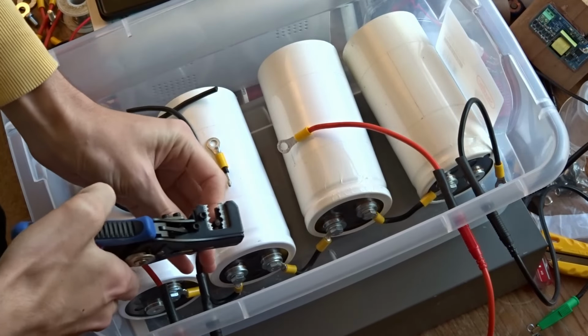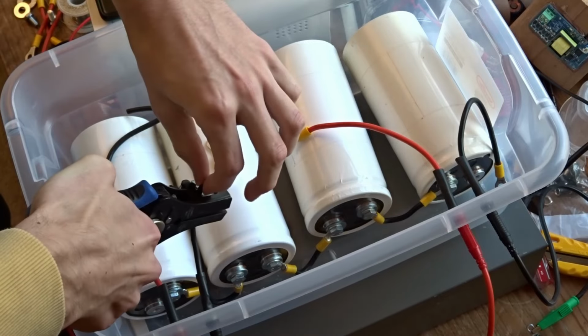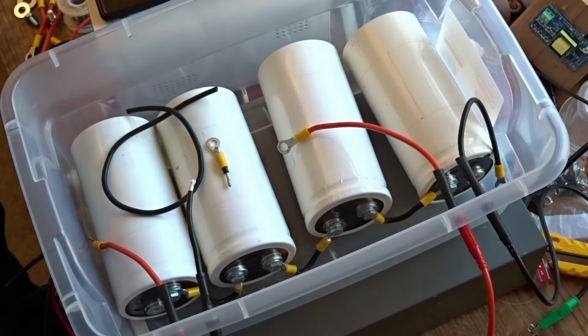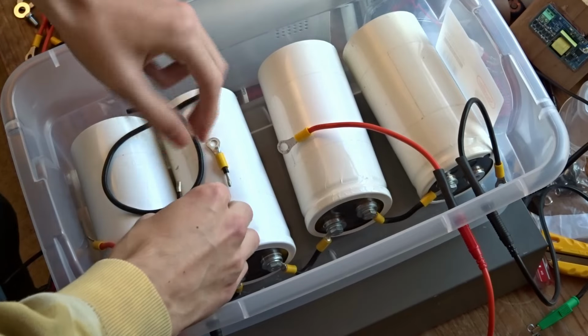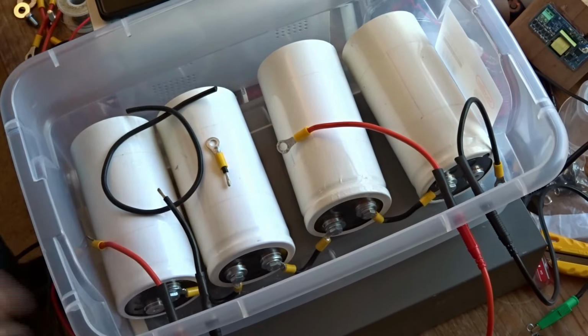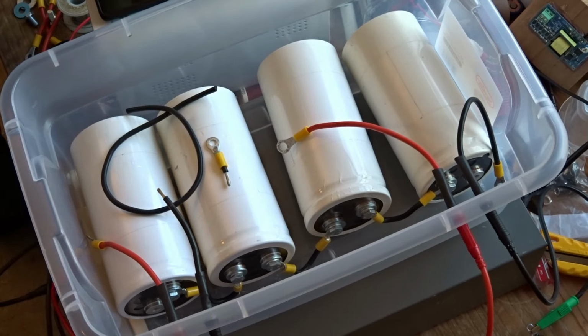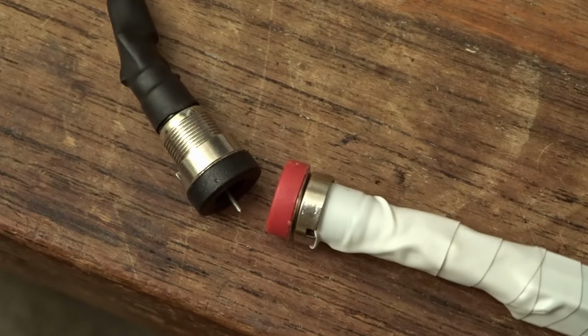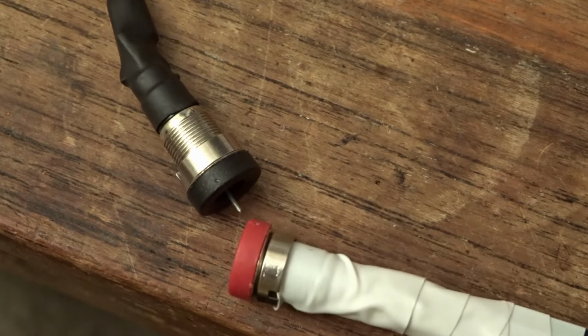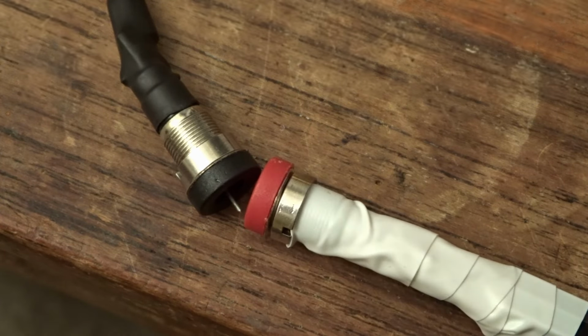This decision was mostly based on the fact that 600 volts was the best electrophoresis PSU I could find at the time. What would have been more optimal is to put my 4 caps in series and end up with like 70 microfarads at a maximum of 3000 volts. This would not only give me a shorter pulse time, but also a higher maximum energy, 324 joules rather than the 200 joules I have now. In fact, I've already built a new high voltage power supply that goes up to 3000 volts. Definitely needs some tweaking, but we should see it in the next video.